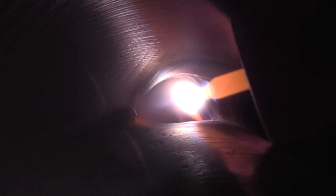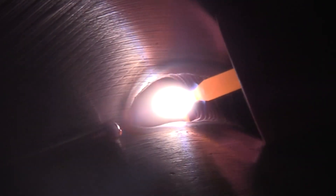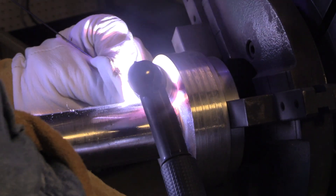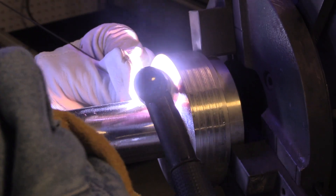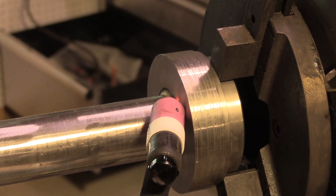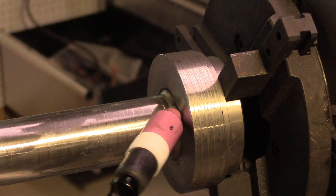I'm not really washing the arc up to the wall — I'm just wiggling it and letting the filler metal flow. You don't have to lay wire either with walking the cup; you can dip it in and out if you'd like to see the front of the puddle to make sure you're flowing down into the root of the joint. But it's a lot easier to just leave it in the puddle, and that's common practice for socket weld pipe joints. This is a lot like a big heavy-duty socket weld pipe joint — think of a two or three inch, six or nine thousand pound fitting that takes multiple passes.